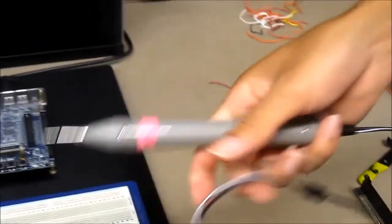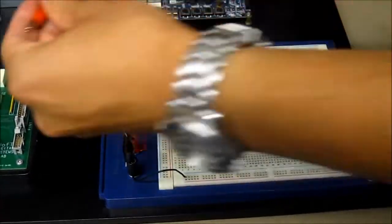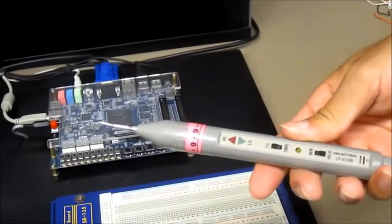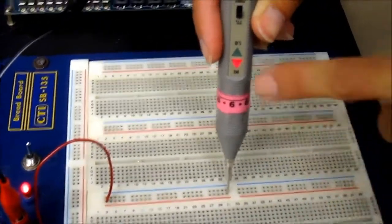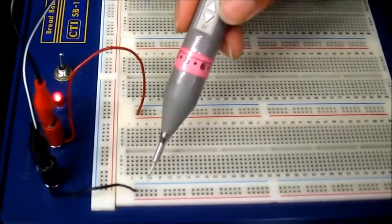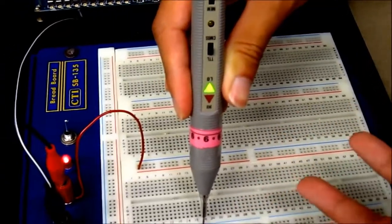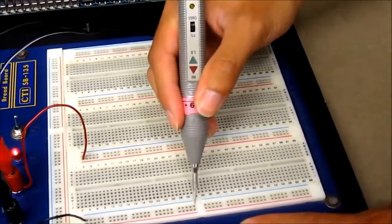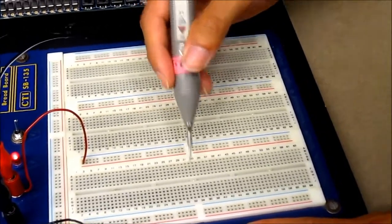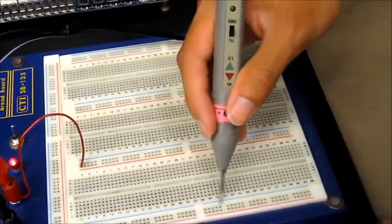We can test whether our connections work. We'll take our logic probe and hook it up to the ground terminal and the power terminal — we need to power our logic probe. If we take it and check any of these pins here, we should be getting logic 1 or power. It says high and you get a high-pitched tone. If we go to ground and test any of these holes here, we get low, or logic 0. Notice that if I were to test any of these pins here, they're unconnected, because there's a gap between these rails. You'd actually have to make a bridge from here to here with another piece of wire in order to put ground to this rail of pins as well.